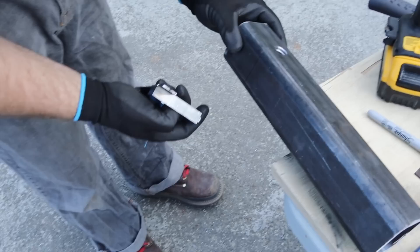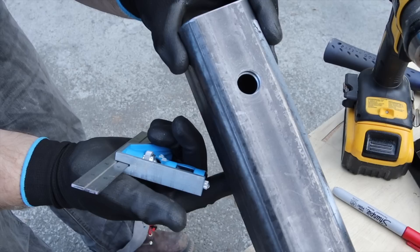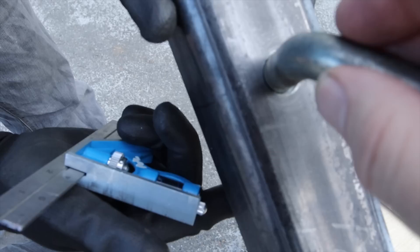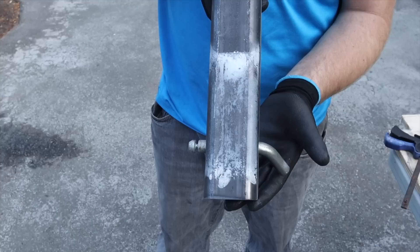First try — he cut the receiver. Now we're drilling for the hitch pin — this is what that looks like. We used a step bit, which gave it a sort of polished then beveled step edge. And it receives the pin.